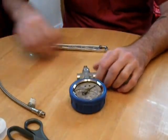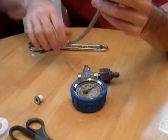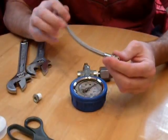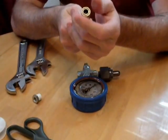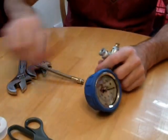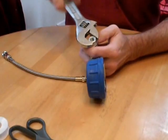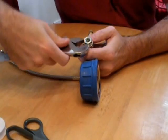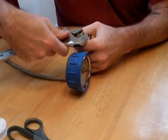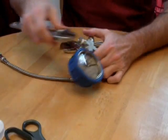The next thing you want is your hose. Your hose will come with one-eighth inch threads on both ends. What you have to do is go on eBay or at a hobby shop and find the one-eighth inch quick connects — they'll come in a pair, a male and a female. Take the male end and put it in your storage. The female end will go on this end. You'll need another adapter because this is eighth inch and that's a quarter inch. Hand tight until you get it to turn, then one little turn — once it's snug, that's in.